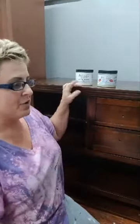So tomorrow I've got all the shelves to do. We've got the whole thing. And with slick stick, you put a coat on. You wait. Hi, Jackie. You wait 2 hours for it to dry, and then you put another coat on and you let that coat dry overnight.